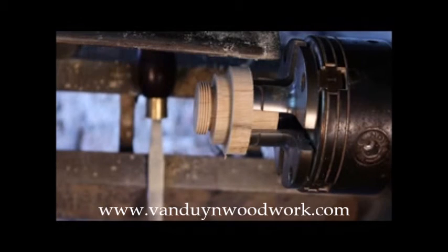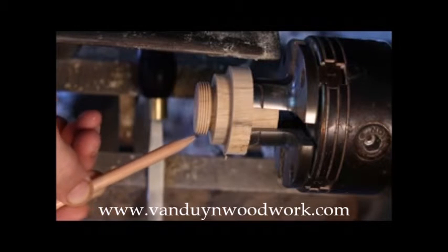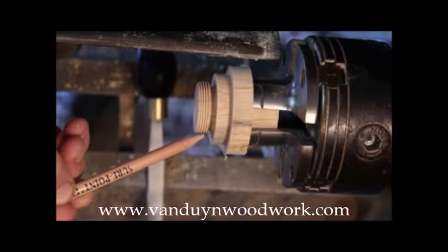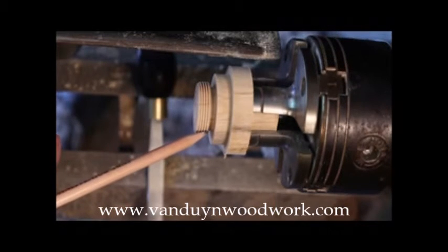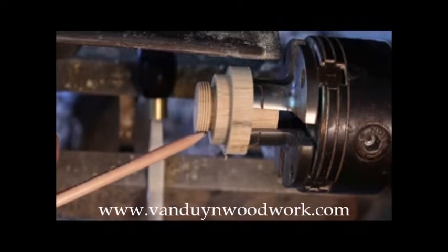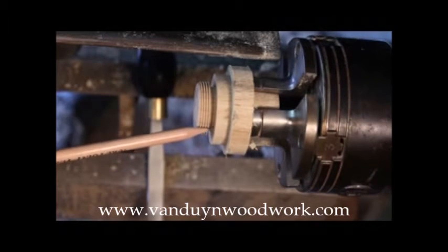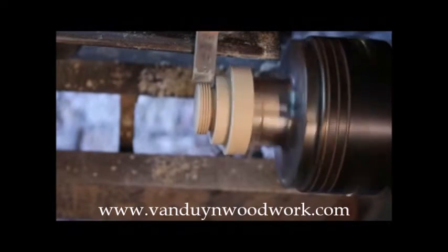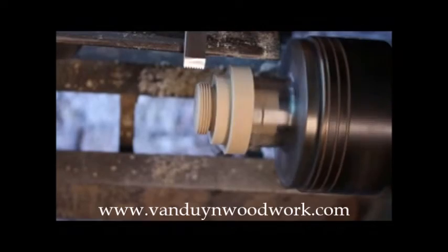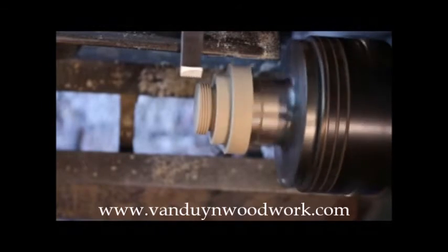What I'm looking at at this point is how the threads are cutting over here. I'm mostly looking at these back threads and I want them to all be about the same height. Currently this back thread's a little bit higher, so I'm putting more of my cutting interest on that back edge. That's basically where your eye's going to be looking — trying to establish that all these threads are at the same equal height. If you want to get those back ones trimmed down, all you're doing is angling your tool over a little bit more until they all get about the same, and then doing even strokes.